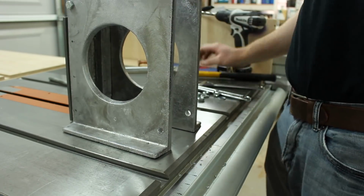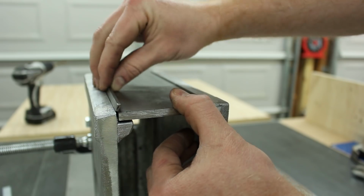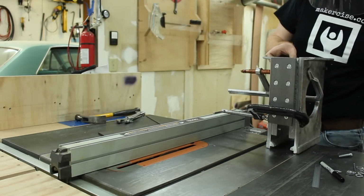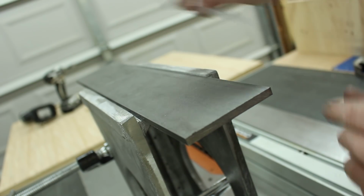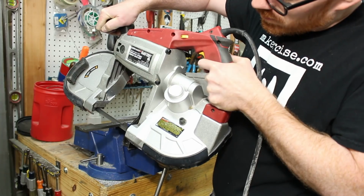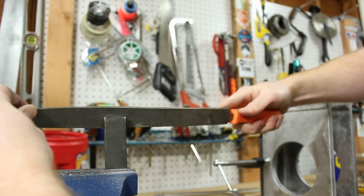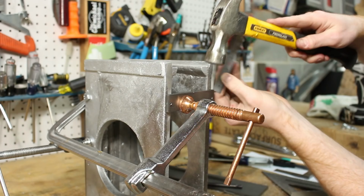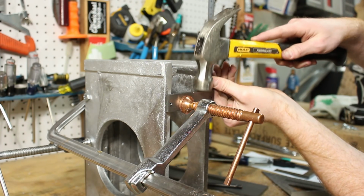Anyway, that seemed to kind of flatten it out enough that I could get the ram slideways installed in the channel up top. I used the table saw to enlarge the channel up top so the 3mm by 6mm gib would fit down in it. And I cut a segment of 6mm by 25mm cold rolled steel to form the upper spreader. It's installed in the rear of the column.